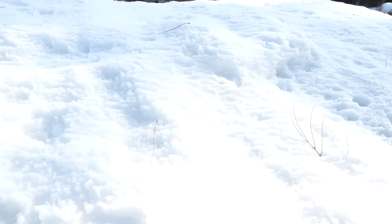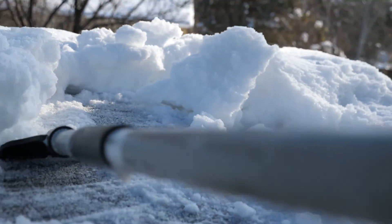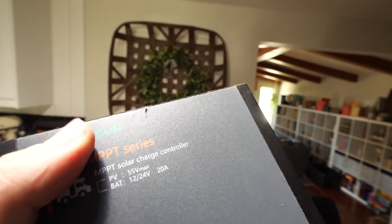Lensun's kit does come with its own MPPT solar controller. What it does is take the higher voltage the panels are pulling in and reduce it down to 14 or 12 volts — you can set different charge profiles. Their system is all set up with large 50-amp Anderson connections. I have an Anderson connection outside the bus that goes right to the MPPT controller, and then that goes right to my battery.